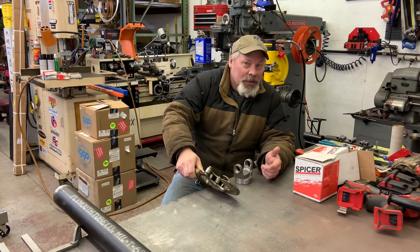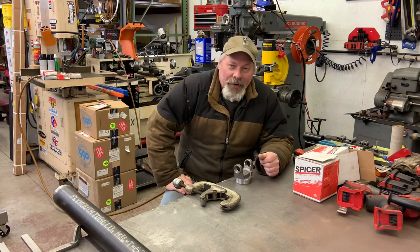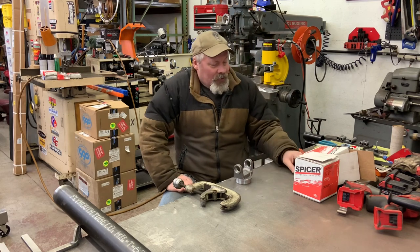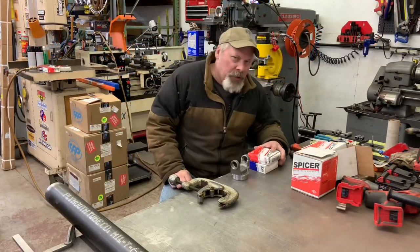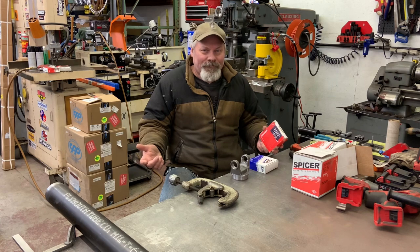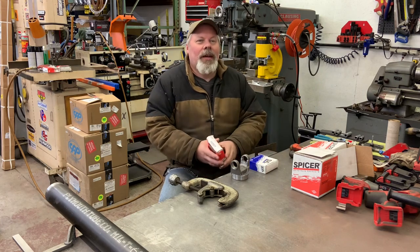If I'm cutting a mild steel tube I can cut it all day — put lube on it and it doesn't hurt the cutter. This chrome moly shaft is hard, very difficult to cut. I'm hoping I get one nice cut without ruining my cutter — the wheel's replaceable but that gets expensive. For U-joint size, the 1350 is my choice for any drive shaft I build. Unless other circumstances come up, if I'm building from scratch, I'm going to go 1350.